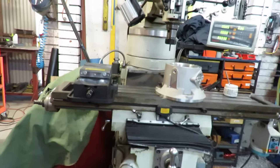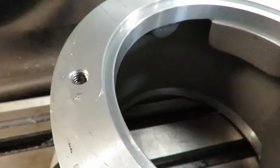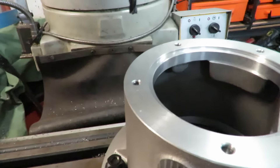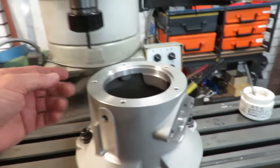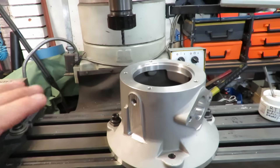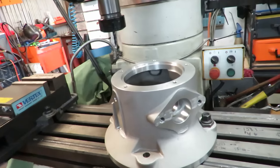Over on the small mill we've got a getter-out here. This is a casting with a broken thread tap — they haven't tapped the rest of them, they broke that tap. So I've got that set up now, ready to go. With a carbide cutter I'm going to slowly machine that out and pull it apart. That carbide tip is smaller than the actual hole, so we just work at that gently and we'll get that one out.